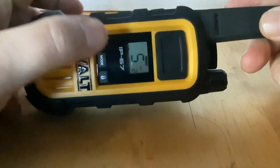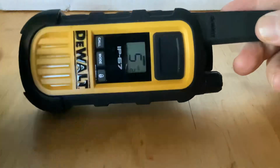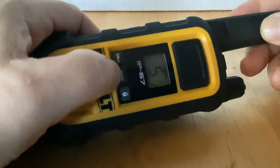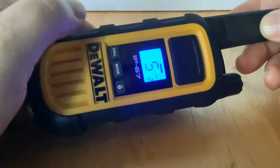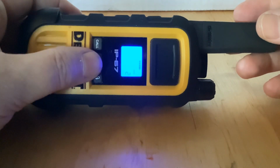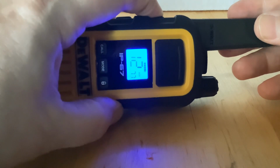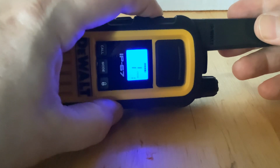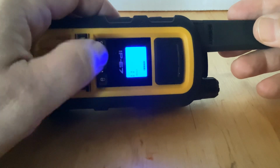Your primary channel and then your privacy code. Or you can just say your privacy code is 0. That's your battery indicator up top. To change everything, you're just going to go into mode. That's my main channel. On the side, you'll see the up and down. Once I get that blinking on mode, I'm going to change my channel. I'm going to change it all the way up. So 22 channels, and now I'm on the low channel. We'll just do 2. Then hit mode again.